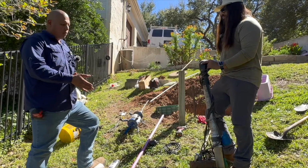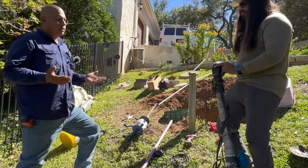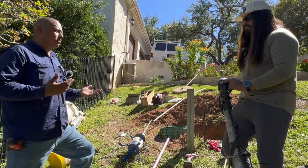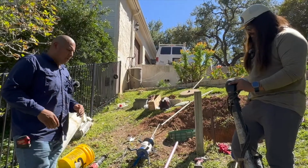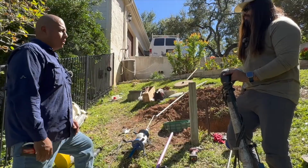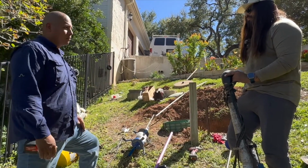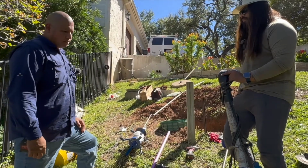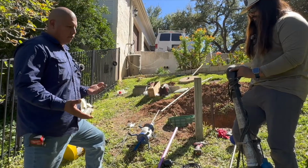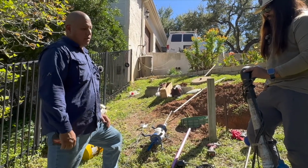I've pulled out pumps before that were the original pump on a house, 20, 25 years old. And it's more than likely due to people doing what they're supposed to be doing, which is pumping out their systems frequently. Right. Every 3 to 5 years, longer if it's maybe a single, maybe a couple. Shorter spans if it's a full house, 2 adults and 5 kids or whatever, or in-laws. So very important to pump out your systems. It's going to increase the longevity of your pumps. But yeah, the main culprit on these guys is going to be just negligence.